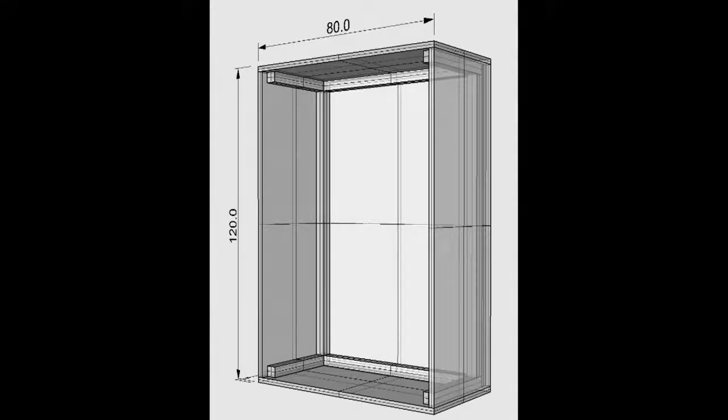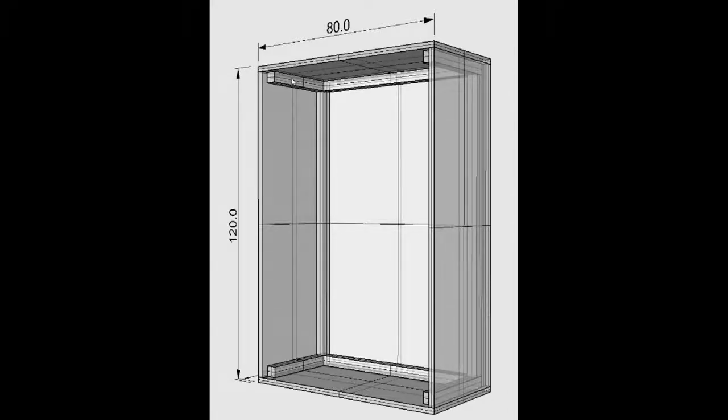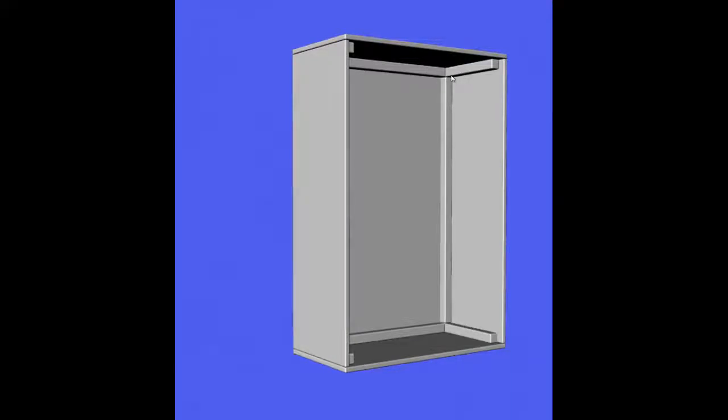The next slide will show you, in case you want to make this a load bearing enclosure, you need to probably reinforce the corners. You have seen that the corners are reinforced using small rectangular pieces of material, which will ensure that these two things join together. You have a lot more extra space to join. This is exactly how, in fact, if you look at an injection molded piece, probably the corners are supported. Any injection molded piece, whenever you have two joints, the corners are supported with that. Now, you see this. The next slide will show you a little closer view of the same parts.